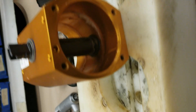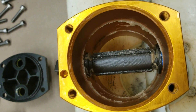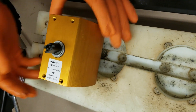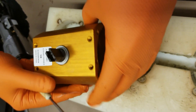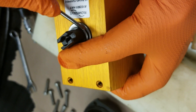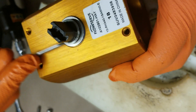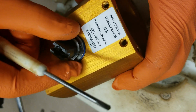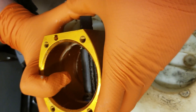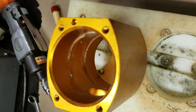We've got the pistons out. Inside the actuator now, all we have is the shaft — the output shaft. Now we want to remove the output shaft. In order to do that, we'll take a small screwdriver. There's a little ring around the actuator — just get it started and work it around, it's almost like a little key ring holder. Get that up and pull the ring off. Then there's a washer on top. You should be able to push the shaft right out the bottom of the actuator housing.